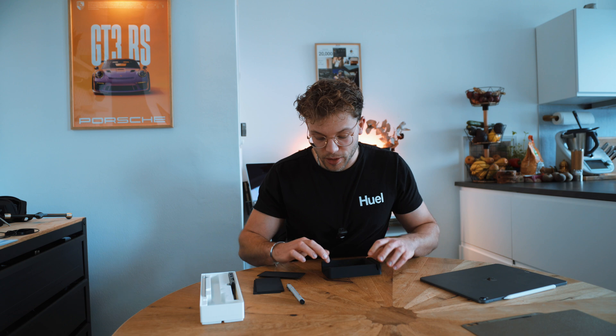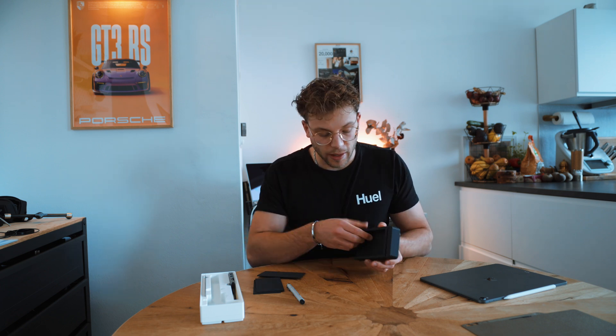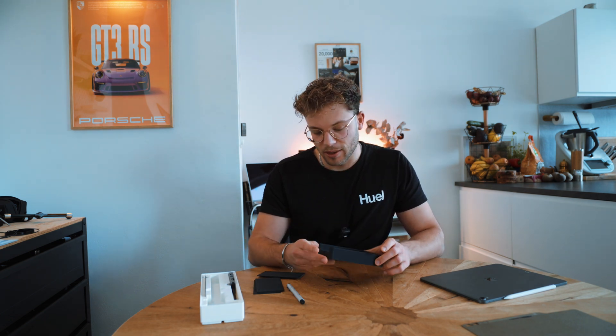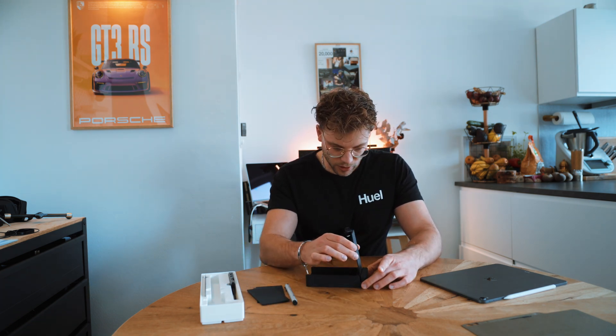There are these lines and I'm not sure whether I like them or not. These lines are because I placed this surface at an angle, so it isn't parallel but at a slight angle. I can get rid of those lines by not printing in this orientation but in this orientation, so the printer can just smoothly follow that line. But then I have this kind of structure on these edges and I have to support this overhang. Somehow I think they look kind of interesting because everything is very symmetrical and this surface is a bit more interesting.